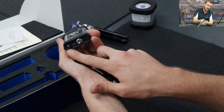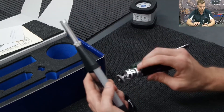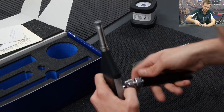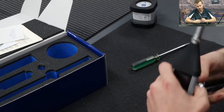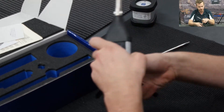Underneath the cap you also have the download cable socket. Once that's done, there's a dust cap for the microphone. We recommend using dust caps when the instrument is sitting in the office, because once dust gets under the microphone gauze it can rip and puncture — meaning you'll be replacing a microphone pretty soon. So keep the microphone as clean as possible.